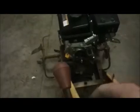But I got an 8mm by 1.25 thread pitch bolt, 80mm long, to fit in there and to hold that mechanism that comes up here to this lever, and you guys see, takes tension off of the belt. The belt would be going through here, and then when you pull the lever up, it puts tension on the belt, and then this lever is hooked like this. It's supposed to lock forward and keep tension on the belt. If it doesn't, now that it's a different design or whatnot, a good old bungee cord right around here to hold this down will work fine, and then I'll be able to pull it up like that to start it.